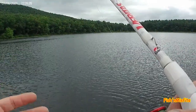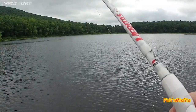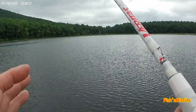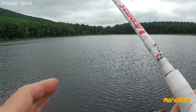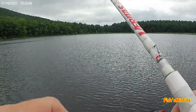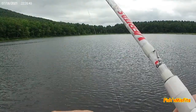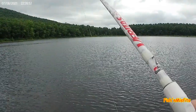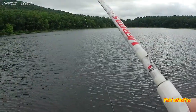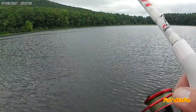I had to buy a new oil tank — cost me $213 — but I was able to install it myself, so it wasn't that hard of a job. The guys I bought it from were helpful with how to bleed the oil line from the tank to the oil pump. My neighbor gave me the proper seven millimeter wrench because I didn't have one, and I was able to fix it myself.